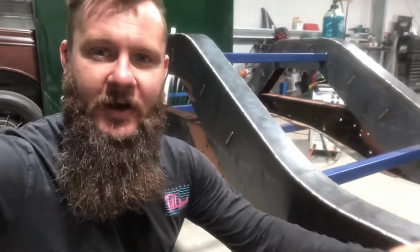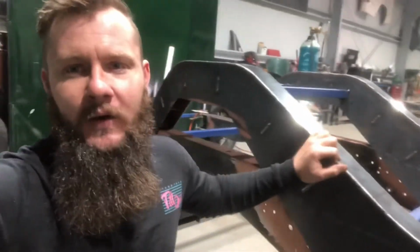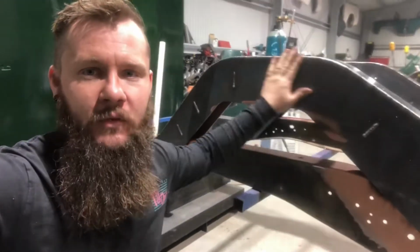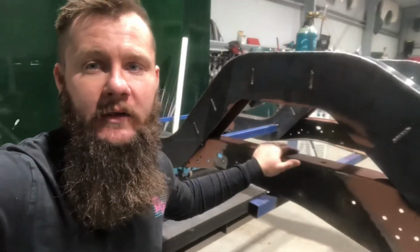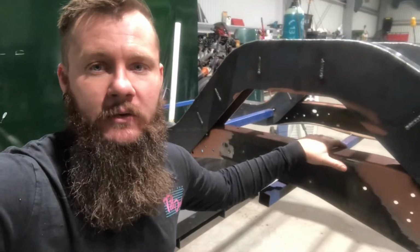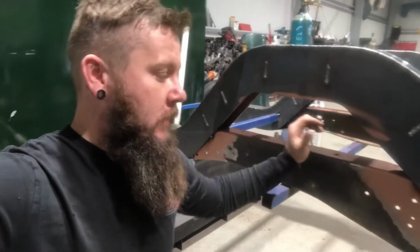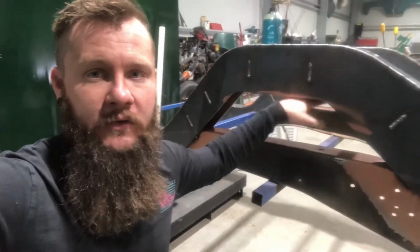But it's welded out. So I've laid some nice big sausage style welds here with a good bit of overlap on the start stops to minimize the low spots I may have to fill by the time this all gets smoothed out. I'm going to go ahead now and cut the center of the chassis out. With this being a C-channel style chassis, I think I'm going to get away with just using a 5-inch grinder. So let's get this lopped out, and then we can do it all again on the underside.